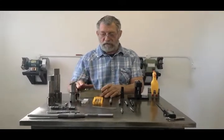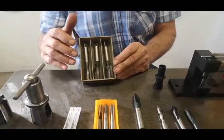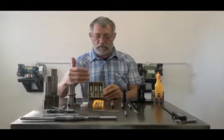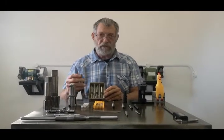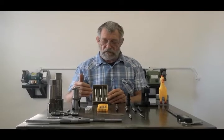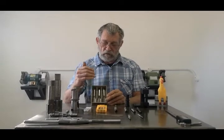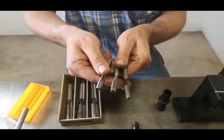If we start with series taps — sets of three — there are a few different types, but in general you get number one, which doesn't have the full form of the thread; number two, a little bit more form; and number three, full form, and it's also a flat bottom so you can tap to the bottom of holes. People will say those taps are rubbish or they're old school — they're certainly not. We use them for moulds, hard steels, tool making, pre-hardened steels where your normal machine taps cannot go through with ease. We open them up, and then you get a really high quality thread. You get them from very small to very large, right down to small millimetre sizes.